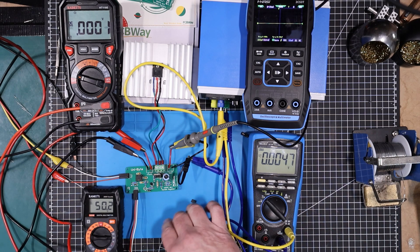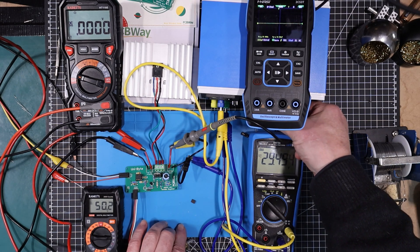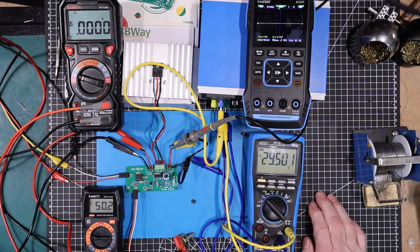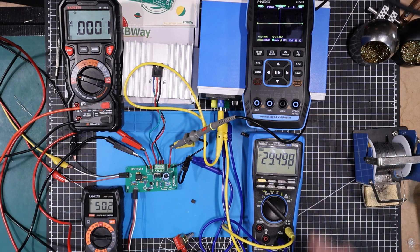Let's crank this up to full output. I'm going to reduce the current a little bit — bring it down to about 1 amp because I don't want that transistor to get too hot. All right, we've got 29.5 volts now — there's a little bit of voltage drop in the wires. Let's see what voltage we can bring the power supply down to and still have 29.5 volts here. I'm hoping it's going to be better than a volt and a half. Okay, we're already beating a volt and a half. 30.9... 30.8... 30.5. So it looks like 30.5 is our dropout voltage at about 1 amp. Maybe a volt and a half at full current. That's good — that's perfect.